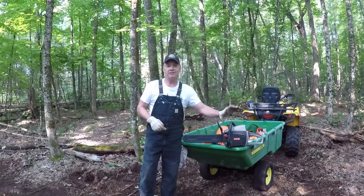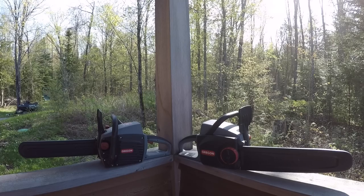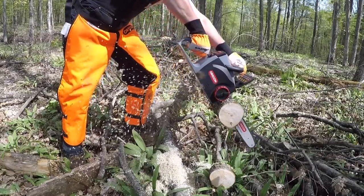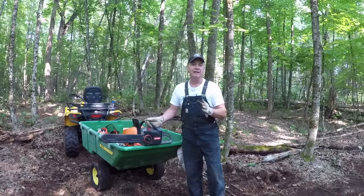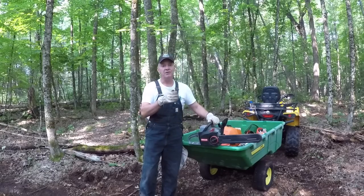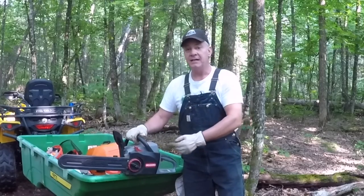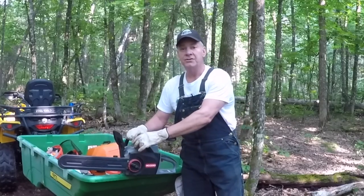About 15 months ago I was introduced to the Oregon Electric CS300 limbing saw — the first time I'd ever used an electric chainsaw. Earlier this year they sent me the CS325, which has different and improved chain and bar technology. It definitely cuts much smoother and more efficiently than the CS300. However, the jury's kind of out right now. One thing I really love about the CS300 is its built-in sharpener. They're both battery-operated and both give you about an hour's worth of cutting time on that six-amp battery. But the nice thing about the 300 is you're out in the forest, she starts to get dull, two or three seconds and you're sharp and going again. The CS325 does not have the self-sharpening feature, so I would stay with the CS300 just for that ease and convenience.